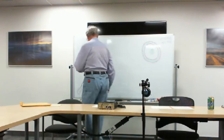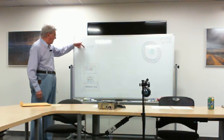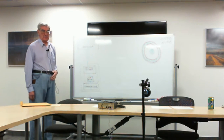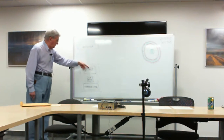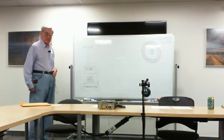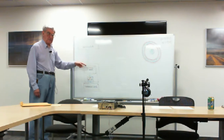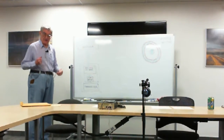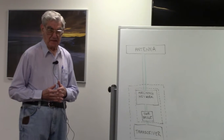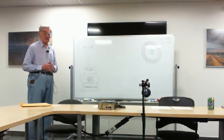At the same time, of course, the matching network does end up reflecting all that power that was originally reflected down back up again. So the only real problem is that on every trip back and forth, there is some loss, because all transmission lines have some loss. But if you're going to be dealing with a situation where you've got a high standing wave ratio, meaning you've got a lot of reflected power, the obvious thing to use is the transmission line that itself has the lowest loss. And typically, ladder line has a loss, expressed in decibels, of only about 1/10 of that of coaxial cable.